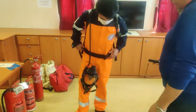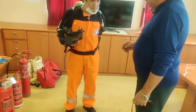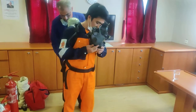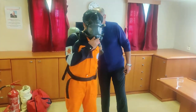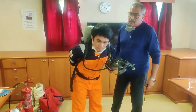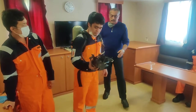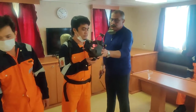We need to do some checks here. And those checks are to check the whistle. Okay? So you open it, and once the bottle is charged, you breathe. Now close the valve. The valve is closed. Breathe. The whistle is working or not? Okay, close this. Okay, now you breathe. The whistle should come when it comes to this mark. So this whistle test is to be carried out.